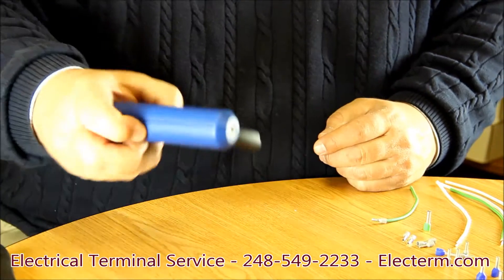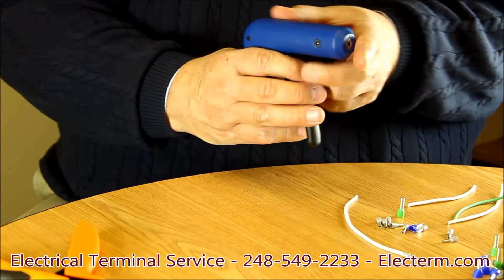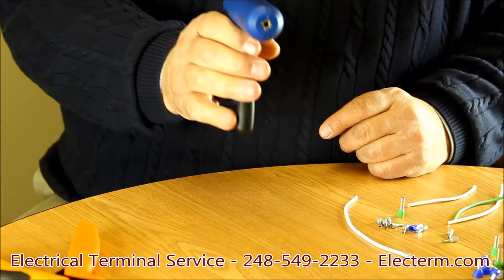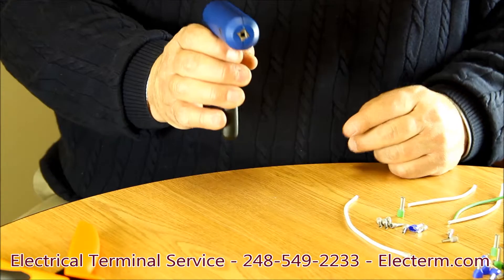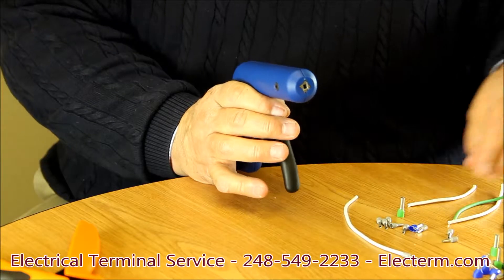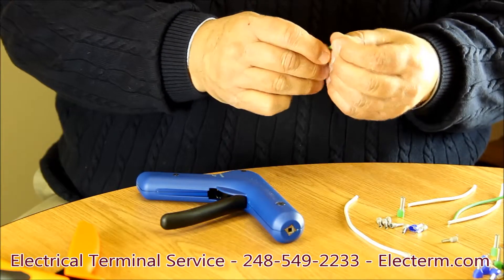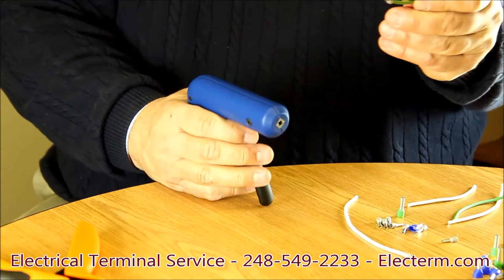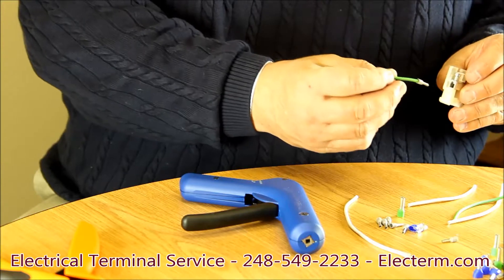What I want to demonstrate is a gun-type tool. It has a very smooth gun action and an elongated metallic body that is good for reaching into a confined space where I can crimp a ferrule in an area I can't access from the side with a typical crimping tool. It has a square crimp on the end. I can take a 14 gauge ferrule, slip it onto some 14 gauge wire, put the entire ferrule in the end of the tool, and crimp it. It makes a square crimp that fits very neatly underneath that terminal block and the set screw.